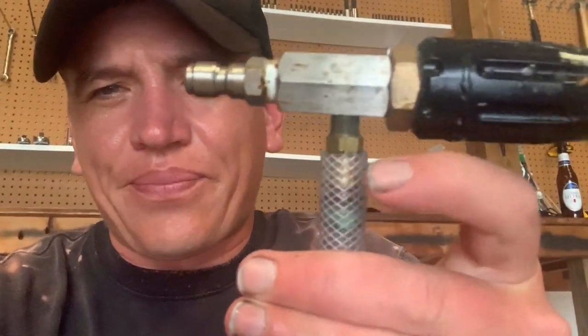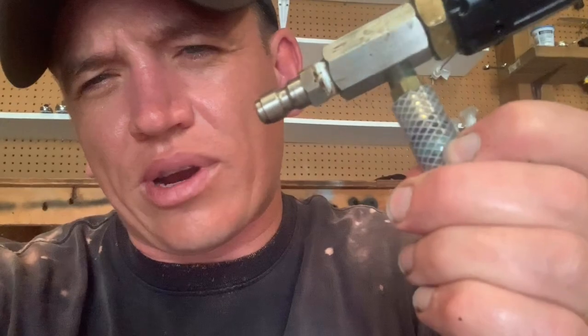Let me show you a little bit more about how it works. The vertical part right here — if you take this hose off — basically they have these plastic proportioners that come inside a bag. Whenever you buy your X-Jet, ensure that you are buying the X-Jet that fits your machine. It's determined by how many gallons per minute you're using. So if you have an 8-gallon-a-minute machine, get the X-Jet that's compatible with 8 gallons a minute — same with a 4-gallon-a-minute machine, which is what I have. If I took this M5 twist off and looked in here, there's an orifice, and the gallons per minute dictates how big that orifice needs to be for pulling your chem.